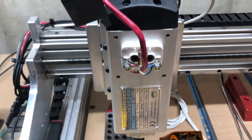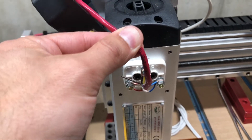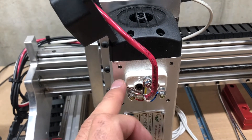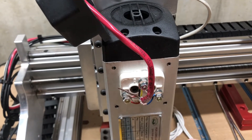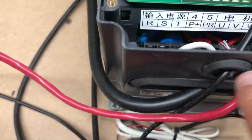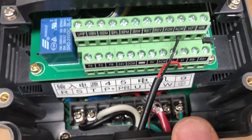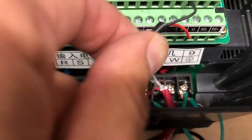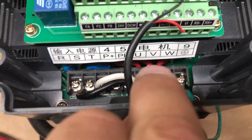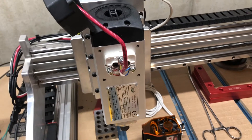Your shielded cable from Home Depot or Lowe's has four wires, but you're only going to use three of them. The three wires go left, center, right — and that maps the same way to U, V, W on the VFD: left, center, right. That's pretty easy.